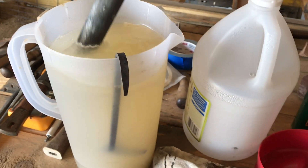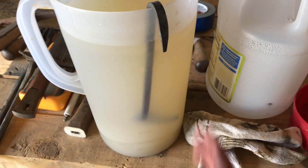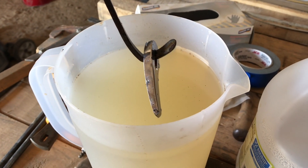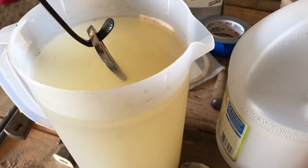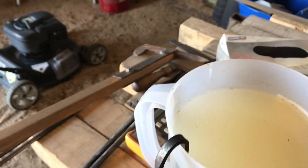Try to break up that steam jacket a little bit. Put that back into the forge. I should say that I always mirror polish my stuff because I feel it brings out the pattern a little bit more. If you just grind it, it just doesn't seem to etch as well, and the little tiny grinder scratches just leave a blurred pattern. But if you mirror polish it, it brings out a much greater wood grain pattern.